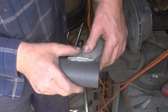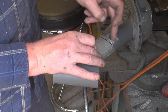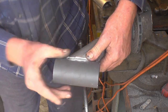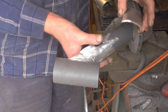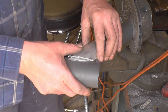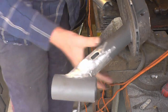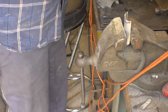It's starting to take shape not too badly. Obviously I can put a weld in and fill those little gaps. On the back end here, just cut it straight, put a little radius on the corners — you don't want to weld all the way around there because that'll cause a weak spot. I'm not going to weld the top, and the bottom tubes are going to be left open. Just a little bit more filing, a little bit more work — that's going to be quite a nice fit on there. I'll tack this one on, then drill that hole through from the back. Then on the other side I can drill through there to hold them in place, and then weld round it. I'll bring the camera in, hopefully get some decent arc shots of it being welded. I'll cut this back bit out — I've already drawn the sort of shape I want on it.